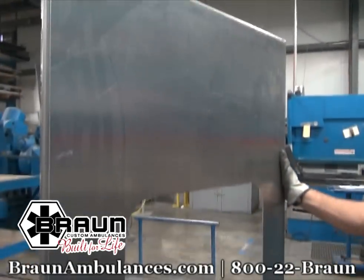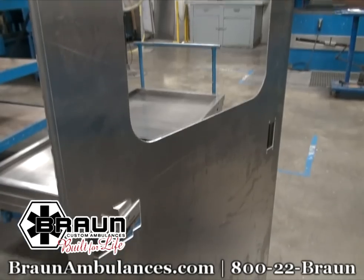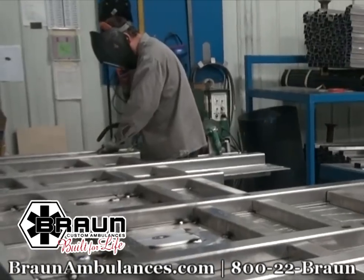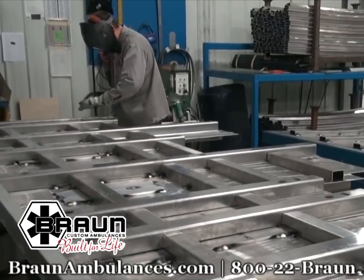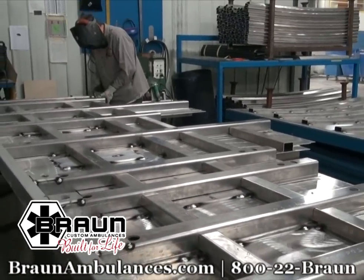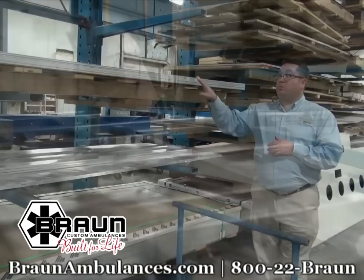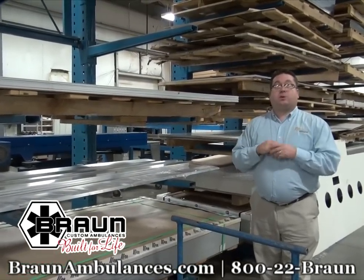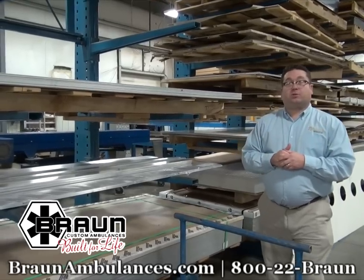So we take all of these cut pieces and bent pieces, put them into a brake press and create a bent C-channel or hat section. We weld that to the skin of the truck to create one unitized body, which provides a stronger yet lighter overall weight vehicle. And we have no dissimilar alloys through the entire truck, thus preventing corrosion. And that's why we're able to offer and extend to you a lifetime structural warranty on the box.